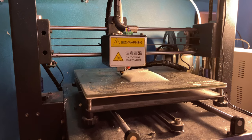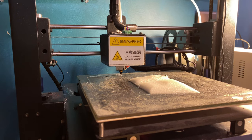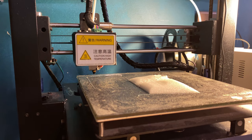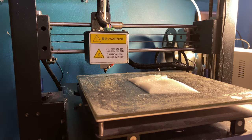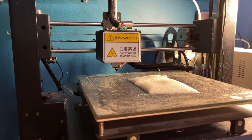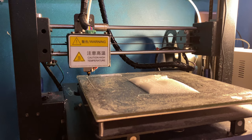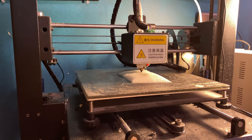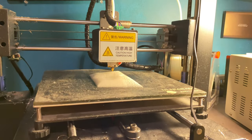Until — yikes! I hadn't inserted the layer transition into the G-code correctly. I wanted the nozzle to go up to a safe altitude, move to the x and y coordinates of the first point of the next layer, then move down to that z-coordinate — avoiding any collision. Instead, I accidentally told it to go straight there, ignoring the part in its way. After fixing this and the misplaced point — though not the stuttering or stringing — the print ran for about four hours and the contoured layers worked like a charm.